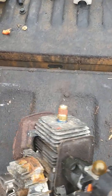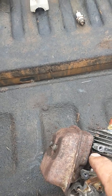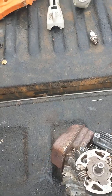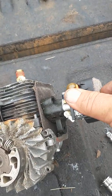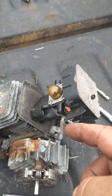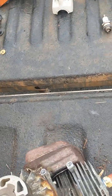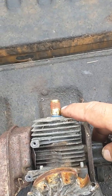I tore this thing apart, cut apart the hydrogen peroxide bottle, and put a gasket back here to block it off. So this whole muffler is really just a way to hold that little piece of plastic in. I gutted the throttle flap and the choke off of this so air could flow through freely, and just left all this whole mess as a way to have an air filter on the thing.